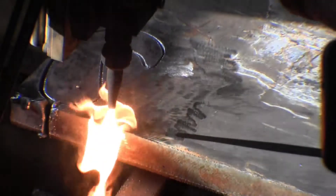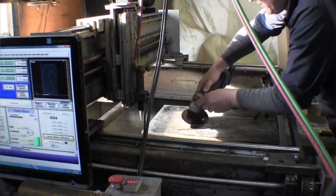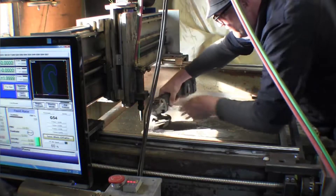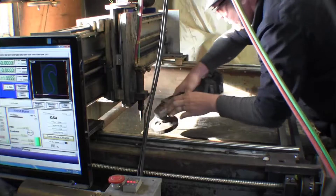Today I was asked to cut out some plates and trade for some supplies, and I'm learning quite a bit along the way. I've never cut metal this thick before, and the first most important thing I learned today was to clean off the slag off the top.